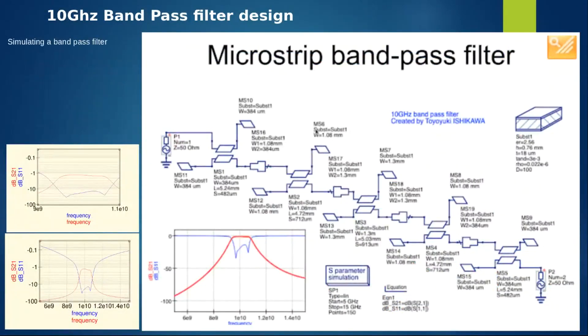I thought, how can we make this cheap? I started looking at maybe designing a PC board which could use standard FR4 type PC boards - the cheaper option, not ideal for 10 GHz but in practice it could be done. Using a simulator, I simulated the bandpass filter for 10 GHz to see if we could make a small board to use if you don't want to build a pipe cap.